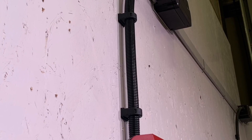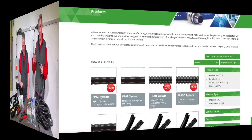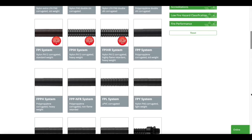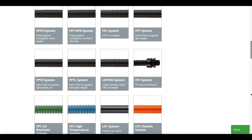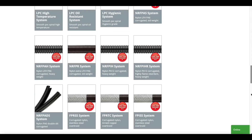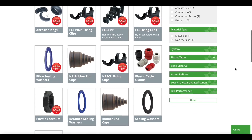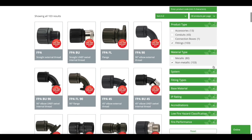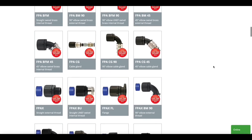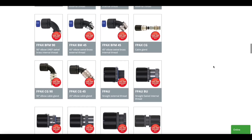When it comes to range, you're normally used to seeing pre-packs on the wholesaler's shelf with glands and clips included, but when you delve into the website there is a lot more to it. The range is absolutely immense for lots of different applications. You can have ones with higher crush ratings, and many have a degree of flame retardancy. We picked the FPAS system for this install to match the IP rating of our system and also the low smoke and fume rating of the cabling. They come in a vast number of different colours too. The gland range is extensive - you can have 90-degree entry, angled glands, and even Y-connectors to combine multiple conduits.